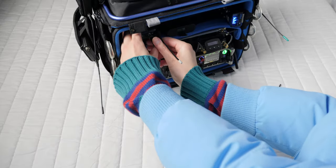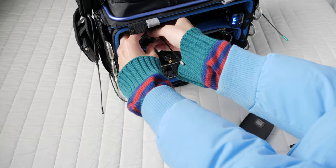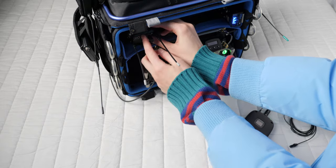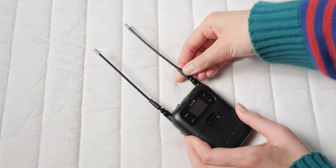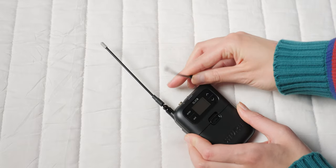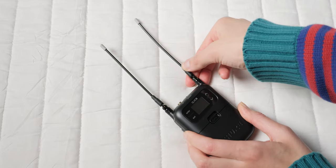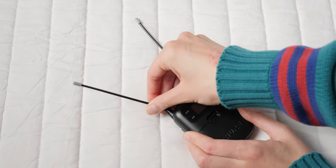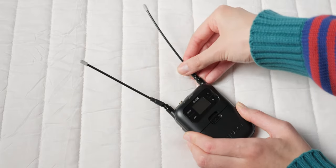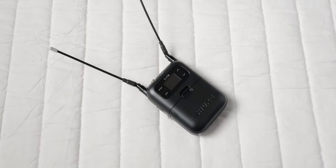Here are the pros. First of all, it's a great camera or sound-bag mountable UHF system. It's a digital wireless microphone system with digital predictive diversity — which I believe is actually antenna diversity. What that means is if the signal is not being picked up by one antenna, the system automatically switches to the other, preventing dropouts. The system features up to 118 dB of dynamic range and transmits 24-bit digital audio, and the latency is extra low.